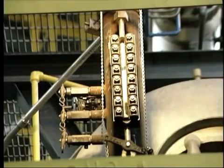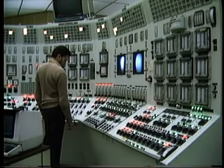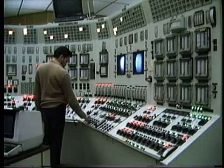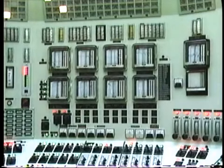During pressure raising on the boiler, attention must be paid to maintaining the correct water level in the drum. As soon as possible, the automatic water level control should be placed in service. Similarly, other controls should be put in automatic service, although this may not be possible until the turbine minimum load has been reached. We'll be discussing monitoring and control systems in detail later.